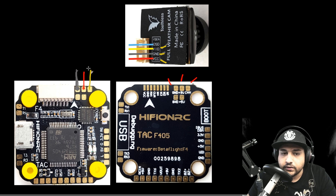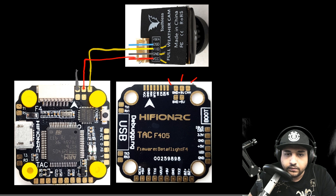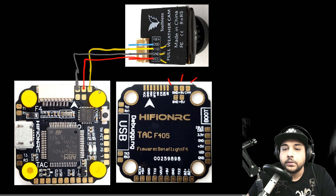The way to install them is simple. Cam goes to the video line — usually the yellow wire. So we have video installed. Next is the 5 volts, which just crosses over right here. Ground is always the black wire — here it's going to be the gray wire. So now we have ground, 5 volts, and video, and basically your camera is completely ready and should be functioning perfectly.